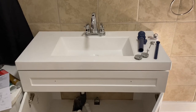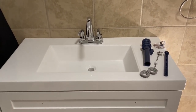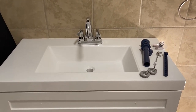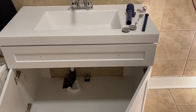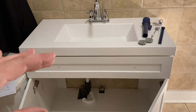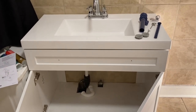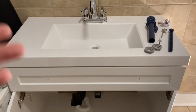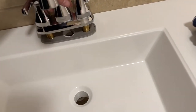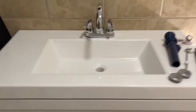We are getting closer to finishing this up. What you need to do now before you secure the sink into place is attach the faucet. If you weren't aware, you need to buy a faucet — whenever you install a new vanity, they don't come with them, at least not the ones I can afford. So we're going to hook up the faucet, hook up the drain stop. After that I will secure the top onto here with silicone, and then hook up the lines and the P-trap. Basically, you're just putting this faucet on here — as you can see, it drops right into place. Hook that into there, and then if you go underneath in the back, you can see where they come in.